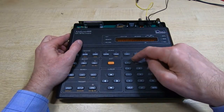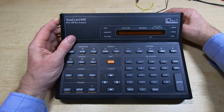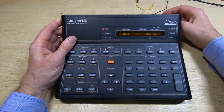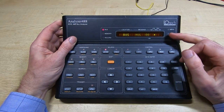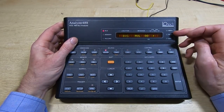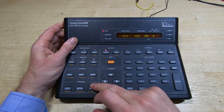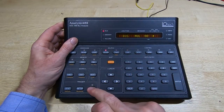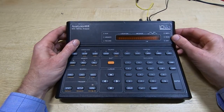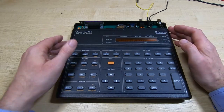We're now reassembled - the device is now refitted - and the fault we'll see now is what I was seeing after I'd replaced the SRAM and fitted the backup battery. We're now getting an NVRAM error. The way the system operates: the NVRAM error occurs when it's getting garbage from the NVRAM. The unit then writes some default data to the NVRAM and continues, which is why it is now apparently working - once you get past that point it actually starts to operate and do what you'd expect.